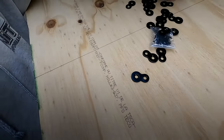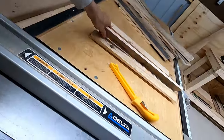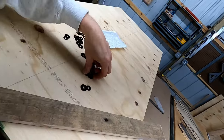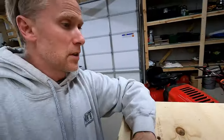I bought these things because I started thinking more and more about how I'm going to attach this after I put all these pieces of pallet wood on here. It's going to be fairly heavy, and I was thinking, oh, I could use dowels, I could use screws, but talk about seasonal movement of this wood. This tabletop certainly is going to move a little bit through the weather, seasons, moisture, and so forth, so I bought 20 of these